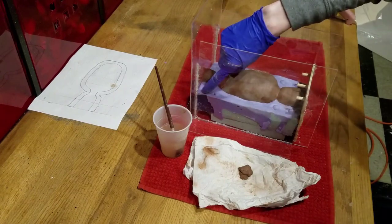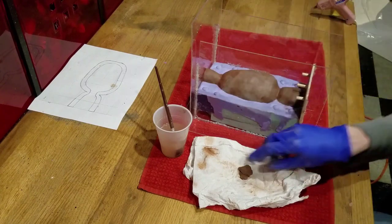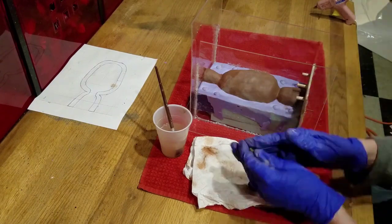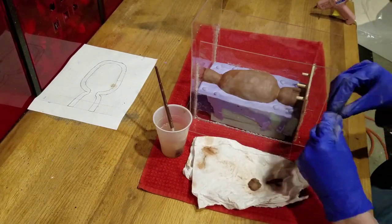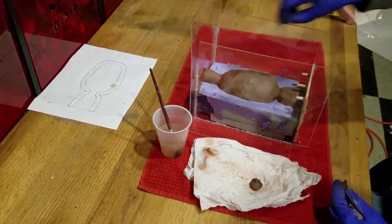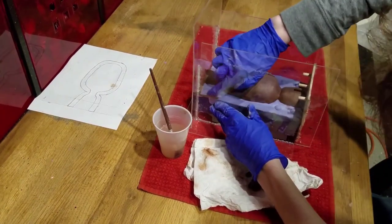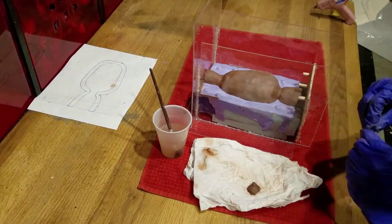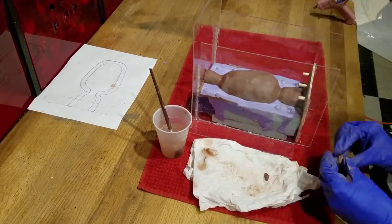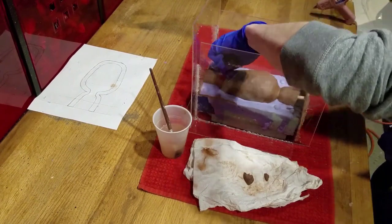Before we can move on to the silicone, we must block the holes along the edge. Because we have to reconstruct our box, there will be small gaps along the edge. You'll want to use the clay to trace the entire perimeter to avoid the silicone leaking down. Trust me, this is very important. If it leaks, you won't be able to split your mold. There's also a special product called Mold Release that can help, but I forgot about it, so something to look into, and I would recommend it because splitting the mold was pretty hard.